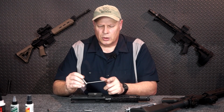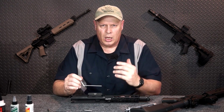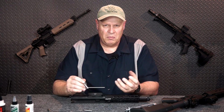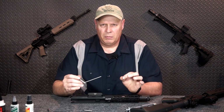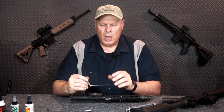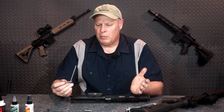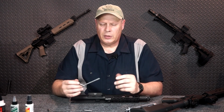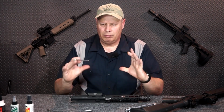But this measures, and when it gets too much, it's going to get further and further in, and it's done. It gets cut by hot flaming gases and little abrasive bits of gunpowder that are being forced out of the front of that case. After a while, it erodes so much that it reduces accuracy. Something that may give you a 1-inch accuracy group at 100 yards may all of a sudden end up being 6, 8, 10 inches.